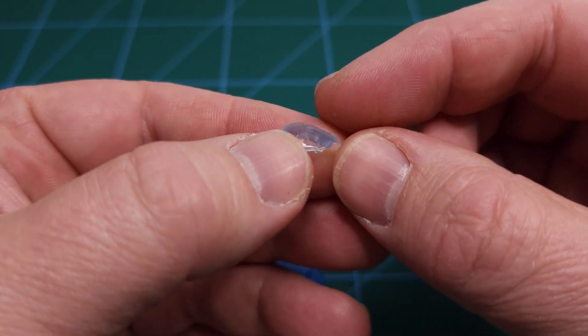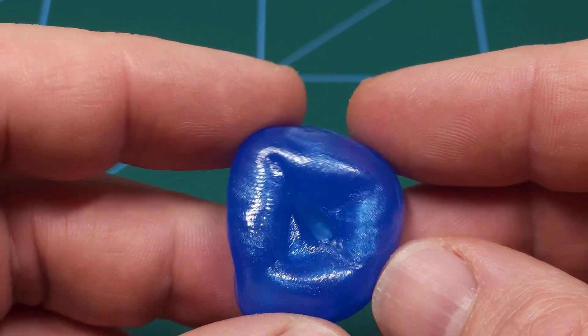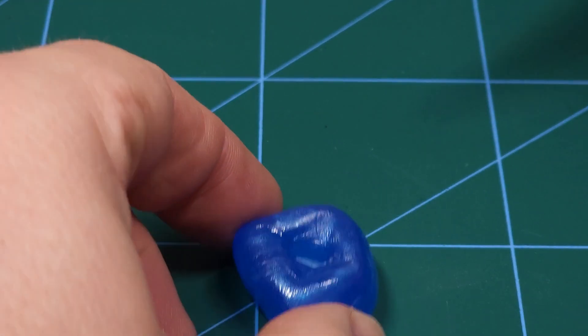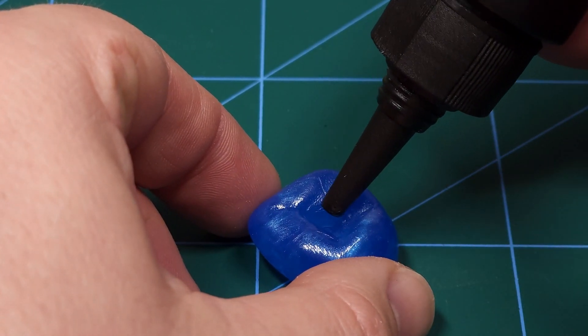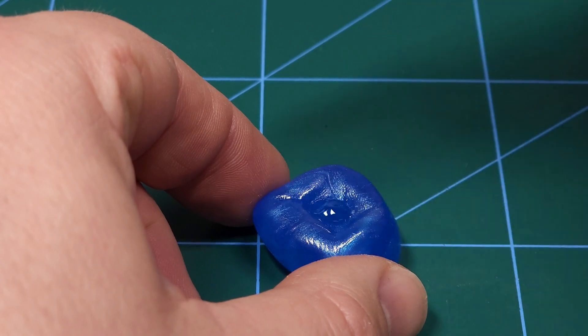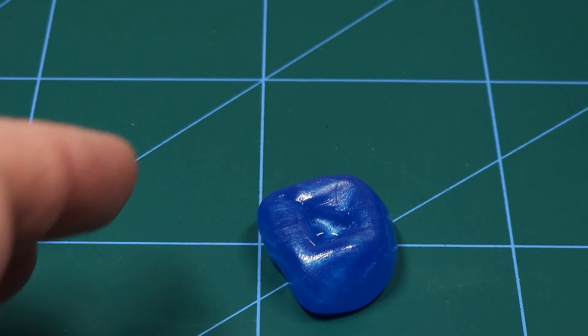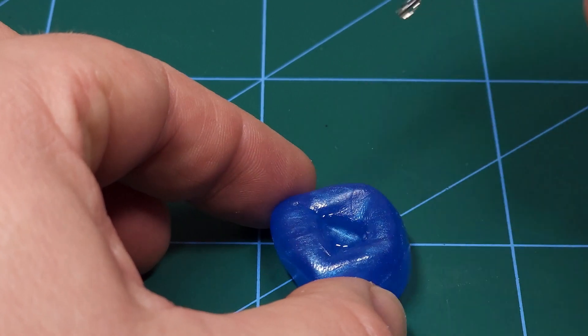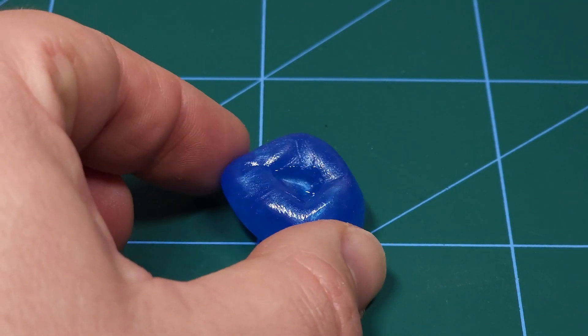With the second attempt I allowed the thermoplastic to cool first and only then did I remove the styrene part. You can see this is a much better mold - it's hardened and is now ready to take the UV resin. Just squeeze a little bit in there, perhaps a little bit more. This time around, to avoid the bubbles, I also used a tool that I made myself just to make sure that I get rid of any air bubbles inside that liquid. So this is now ready to go into the hardening process.